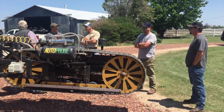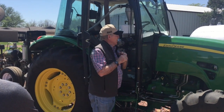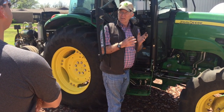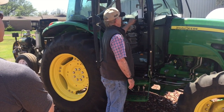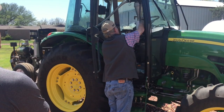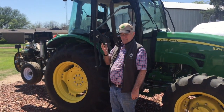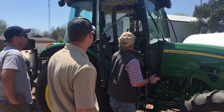This is a cyclone that the dirt is delivered to. It has a stirrer in here that is turning all the time to keep the dirt from sticking to the cyclone. It also has another fan up here that's pulling there so that it'll make a negative pressure on the end of this tube — so you don't get dusted out in the cab in really dry ground, it'll throw the dust outside. And this is a quick-change contraction where you push it down and move it over to change into the next bag. He's got a computer on board and he can see where he is in the grid, and when he crosses the grid line, he changes bags.